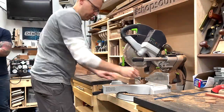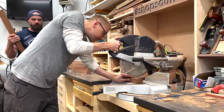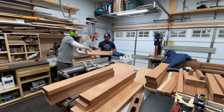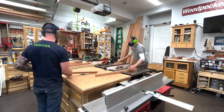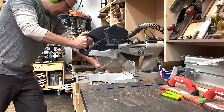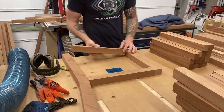Day two started by flushing up the ends, top and bottom of each leg to their correct angle. I wasn't super comfortable with that operation on the router table with our template since it was end grain. Then we headed over to the jointer to get a nice, crisp, clean square reference edge to rip all of our parts down for our seat frames as well as the other parts for our legs. They are inch-and-three-quarters square — I left them a little bit strong so we could run them all through the thickness planer to make sure they're exactly the same. Before batching out all of our parts, we wanted to do a quick dry fit assembly, so I cut a couple pieces to length and Jason went to work. That right there is our basic leg frame assembly — we're going to need eight of those.